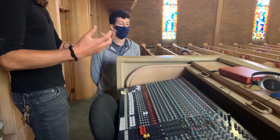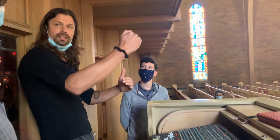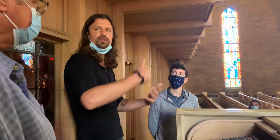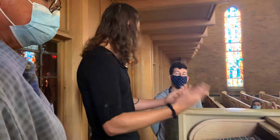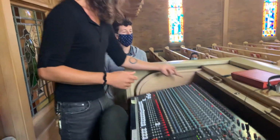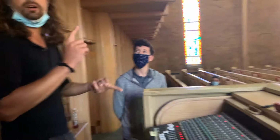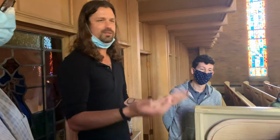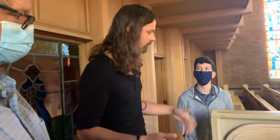like any electrical signal, you need a certain strength in order for that to come in with clarity and carry all of the information that it has within that signal, right? So if you run this knob too quietly, the signal is weak, so it's going to sound thin. It's not going to necessarily carry as well. You're going to lose detail. But if you run that too hot, you're inevitably going to run into distortion and, I'm sure, feeding back and all of those overwhelming things, right?